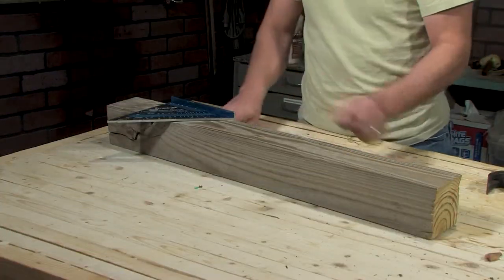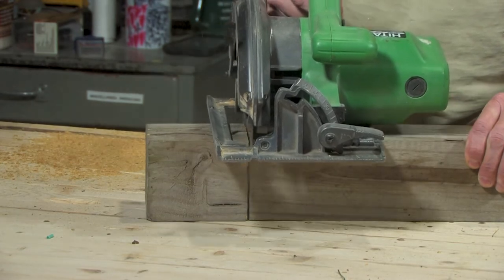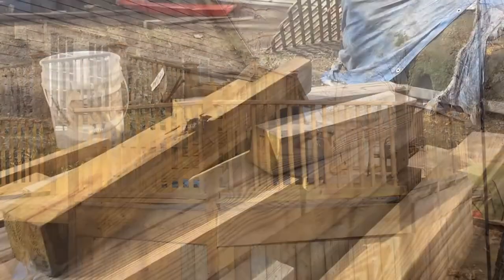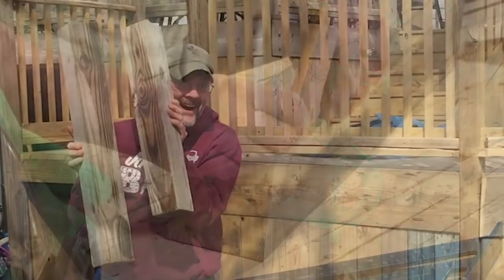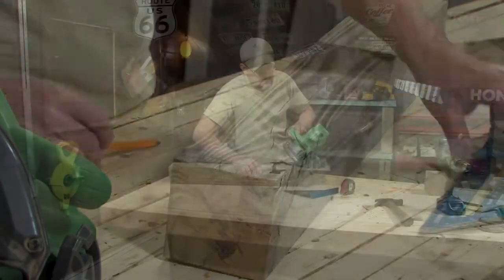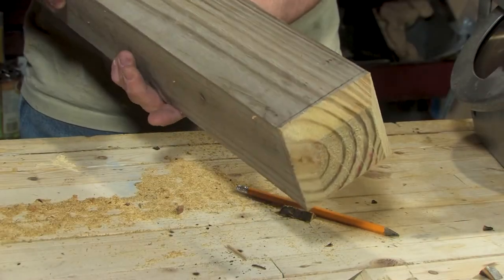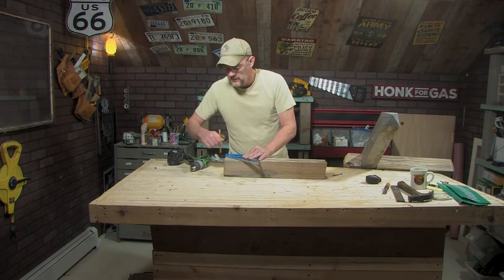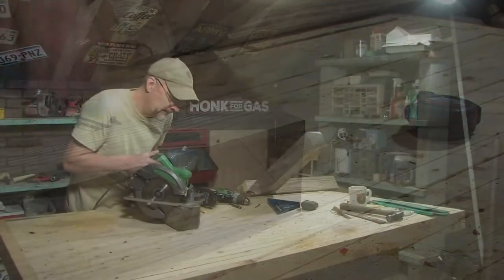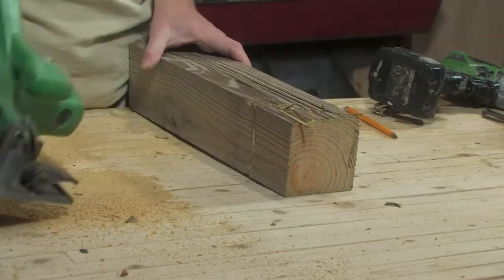Step 3: Transfer your measurements to your material and cut to length. Before you run out and buy new wood to make the repairs, look around your house or ask a neighbor if they have any scraps. The 4x4 pieces I am using were leftover end cuts from my deck project, keeping this project within my desired budget of $0. To add a little design to the mailbox mounting beam, I measured and marked a line 1 inch from the end all the way around. Then I used my skill saw to make a 45 degree angled cut, leaving a nice finished beveled edge. Cutting the angle support was less difficult — this was a scrap piece that I had lying around, and it just happened to be 20 inches long. Hey, sometimes you get lucky like that and you find a scrap that is exactly what you need. The only thing I had to do here was mark a 45 degree angle on each end and cut. Too easy.